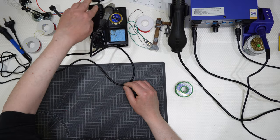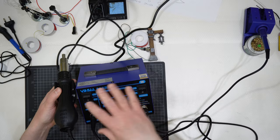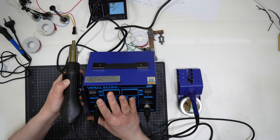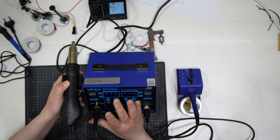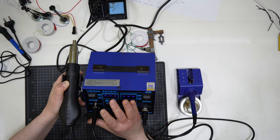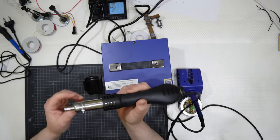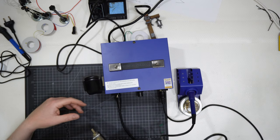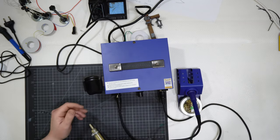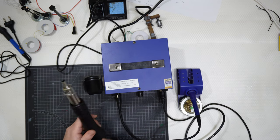Then there are, and let me switch this off, professional soldering stations like this one that is big, with a main central unit there and two tools there. I use these only for very important work, for my very precise, micro precise PCB works, when I need to get very precise in my work, and if I need to desolder something, because this comes with a hot air blowing tool that has a tip there, and it will blow hot air onto something I have to desolder, instead of applying the tip of the iron on top of something, you will use hot air. And you will use also hot air to shrink the plastic shrinking tubes there.